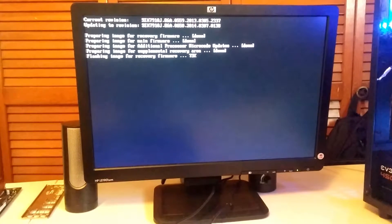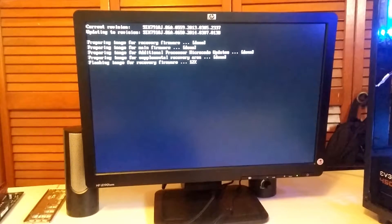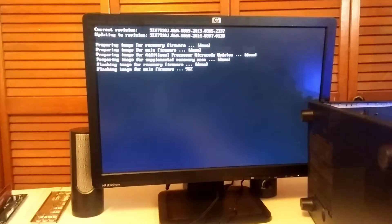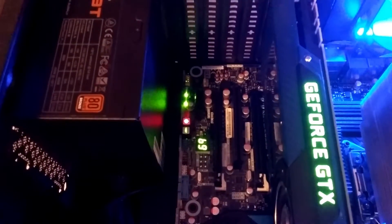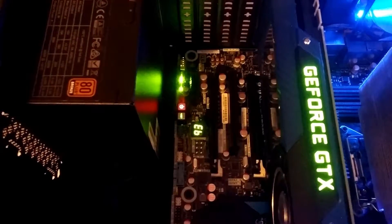Luckily, Intel has various different options. I went with the recovery option, which required me to remove the BIOS config jumper and plug in a flash drive with the BIOS file at its root. To my surprise, using the latest BIOS file available, the diagnostic LED started freaking out and the installation menu popped up. The original BIOS was from 2013 and the newest available was 2014. I flipped my case over and laid my cooler on the IHS just to avoid interrupting the installation. Once it finished, I powered off, removed the flash drive, reinserted the BIOS config jumper, and there you have it — a fully functional X79 motherboard for $50, not from China, that can actually overclock.